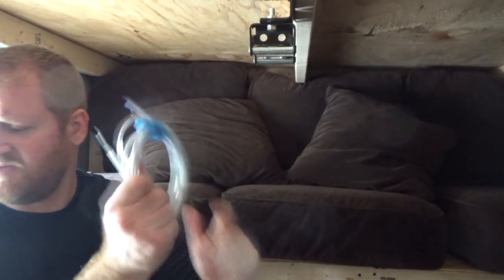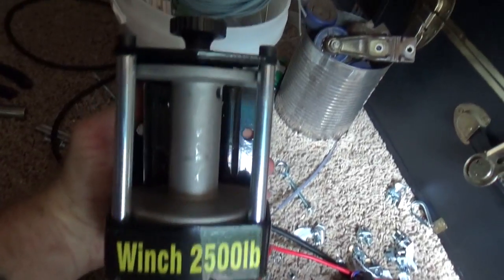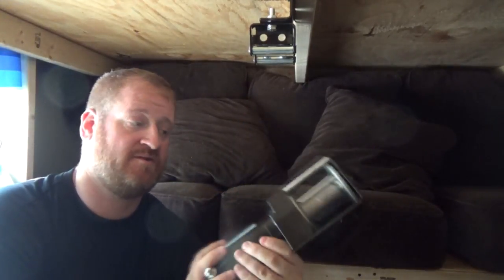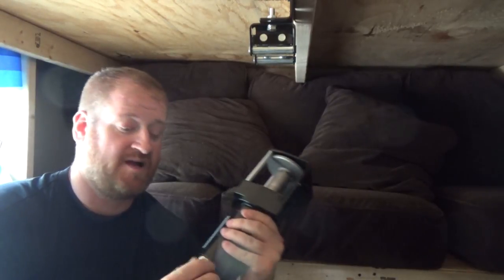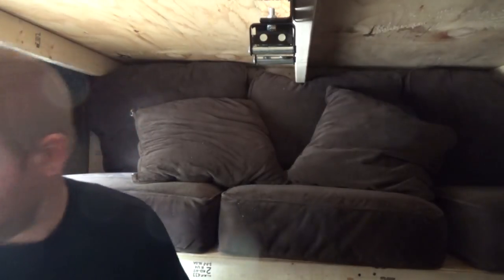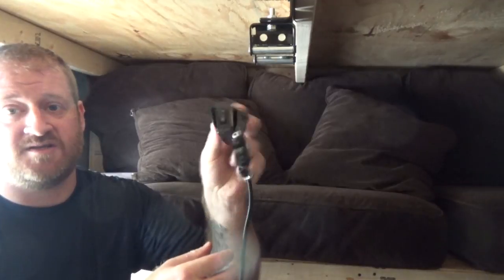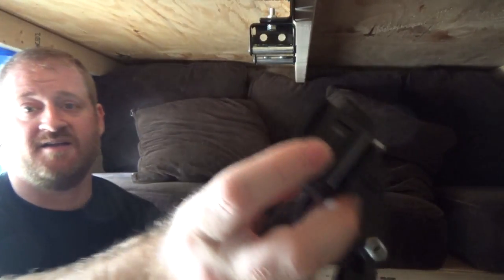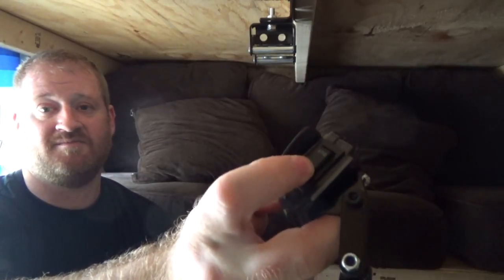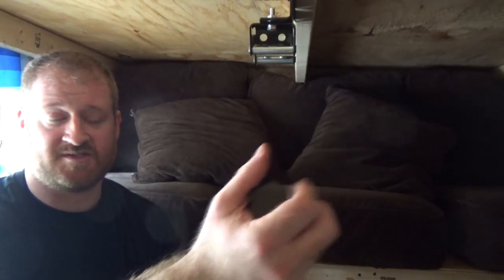These are about 500-pound test cables apiece. The winch is a 2,500-pound winch I got on Amazon for about $80, so the jury's still out on whether that's a good one. It's pretty easy to control — it has a remote with a simple spring-loaded in-and-out option that you have to hold the whole time, and when you let go it stops from whatever direction it's going.